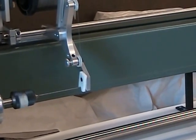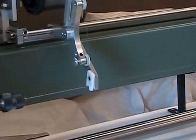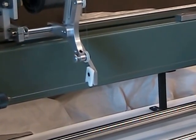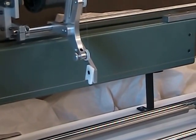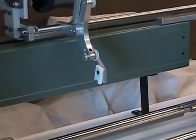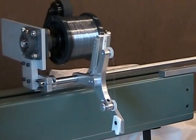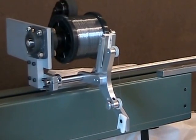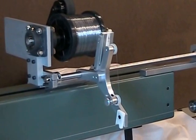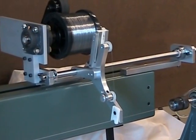You can see there is a drive shaft which transmits power to the opposing chuck. This allows for the coordinated rotation of both ends of the wire mandrel under power. The source spool of heater core wire is mounted on a constant tensioned wire feed device, which is mounted directly to the traverse assembly. The source spool traverses at the same rate as the coil as it is wound, allowing the source wire to maintain a narrow angle to the mandrel wire.